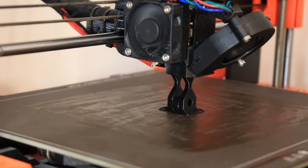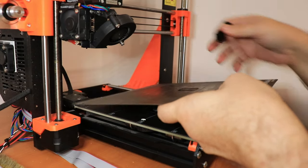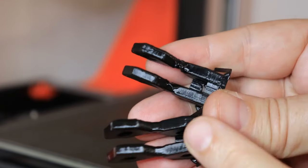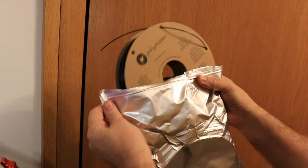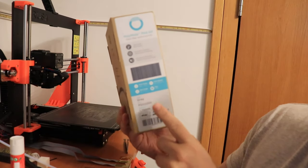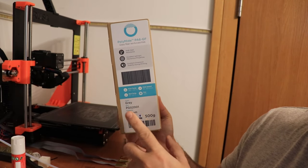All other fiber materials in this video I printed with this same method separately. The new test objects look much better in the middle part. The end of the filament is locked and goes back to the receiver bag. Next is PA6 glass fiber. The printing temperature is between 280 and 300 degrees Celsius, but the temperature tower will be from 290 down to 280 degrees.